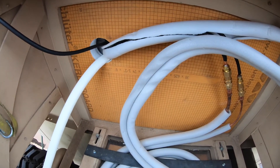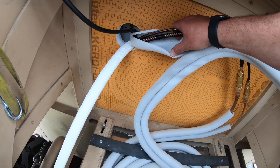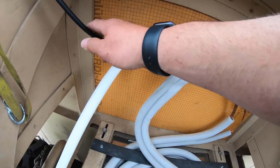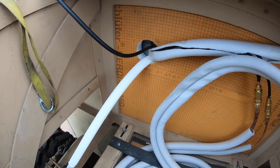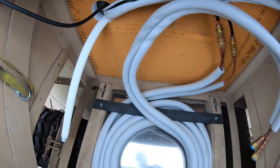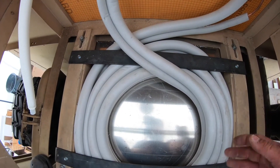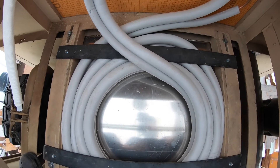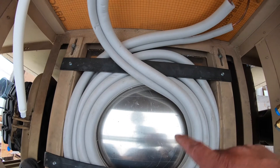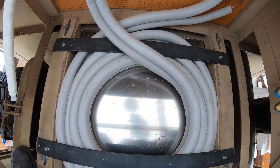This is the backside of the mini split indoor unit. Coming out of here we've got three things: a drain line, our two condenser lines — the big one and the small one — and then the power cable. One thing that was mentioned when I called Mr. Cool was that if you have to coil the lines up, you should do so laying flat. I cut a piece of aluminum and bolted it from the bottom up into the 1079 box AC compartment, then used pieces of flat strap to pin it down so the whole loop is coiled and laid flat — because oil will pool in the lines and cause it to cool less efficiently.